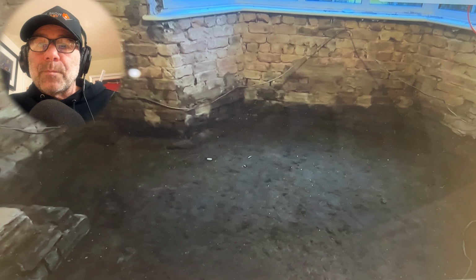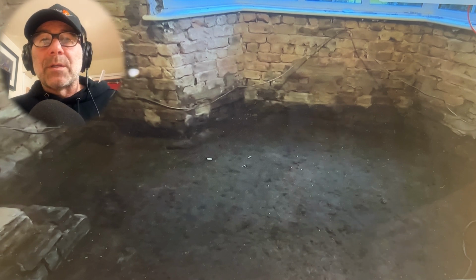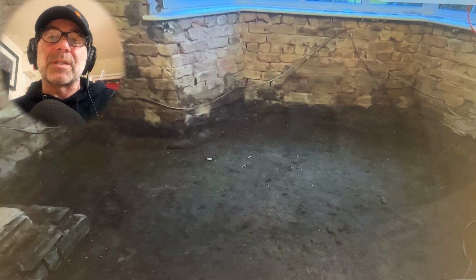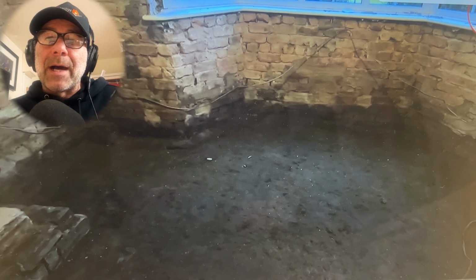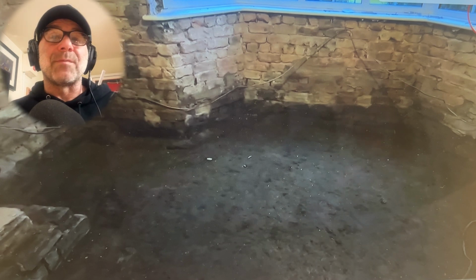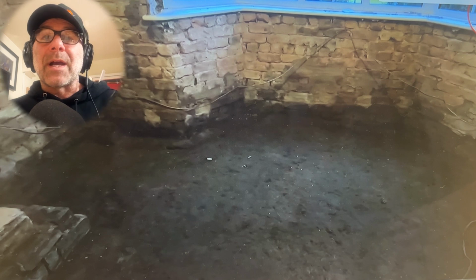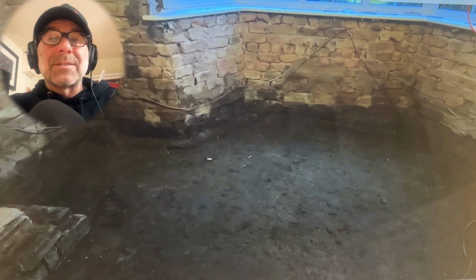So here we go. Right, so he's had standing water in his subfloor, which is not an uncommon problem. There's a lot of areas where you might have an underground stream or river, and when it rains, the water table rises up, and it can come into some subfloors, especially if they're earth oversite. And if you've got standing water, then that water's got to evaporate out into the atmosphere. And what tends to happen is if it's not ventilated adequately underneath, then wood timber being hygroscopic will absorb that moisture, and it'll be at risk of decay and wood-boring insect attack.